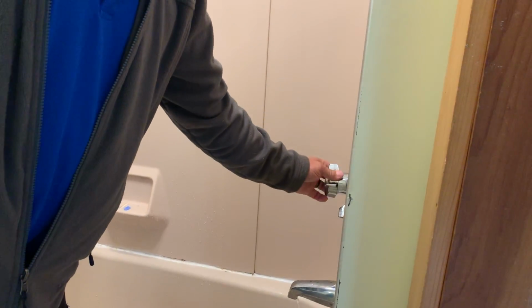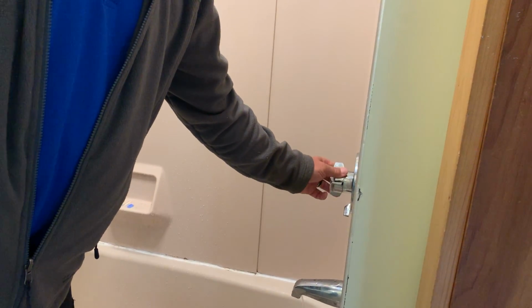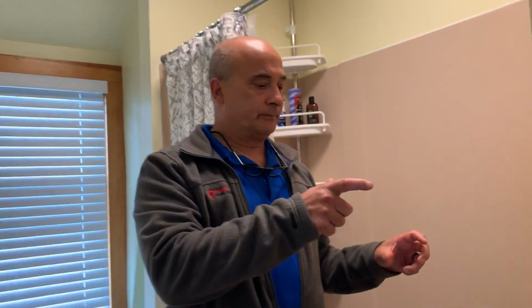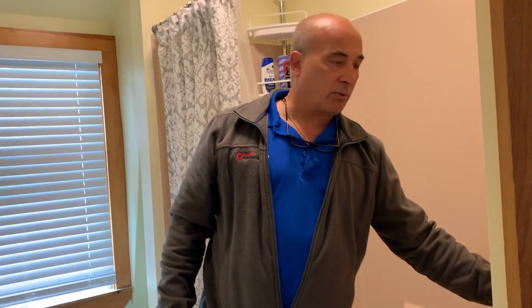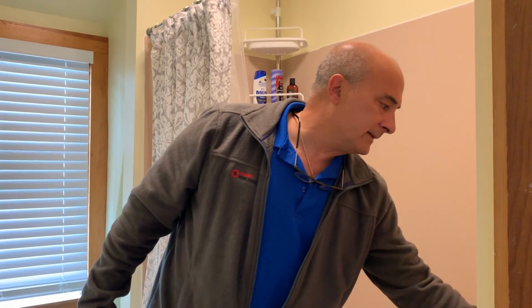Hear that thump? You guys hear it? Yeah. What's happening is the stem in there is jolting forward. This is an old Simmons. If you take this off, there's probably a nut right there, and you tighten that down, and it'll stop the stem from popping. But it's also, and you go, you hear that banging noise? So the person says, yeah, this is an area where you could talk about a rebuild here. How long you been living here? Only a year. Geez, I wonder if anyone ever rebuilt this, might be a good option to put down for a rebuild. So that's how you talk about the rebuild, okay?